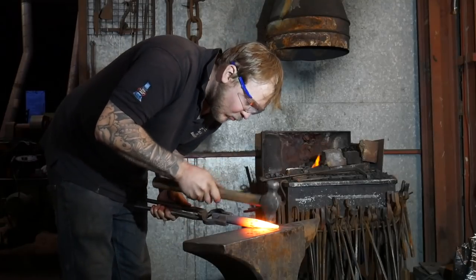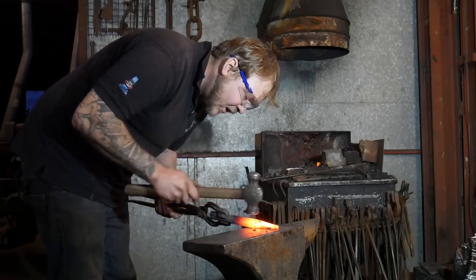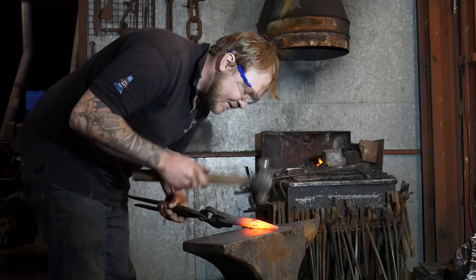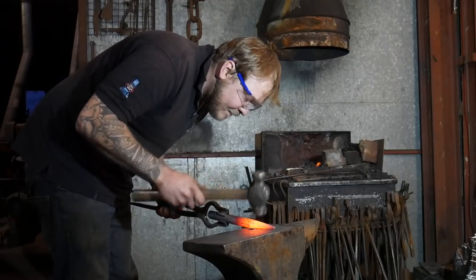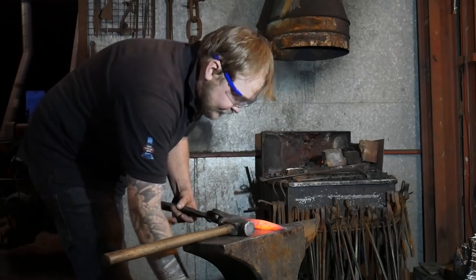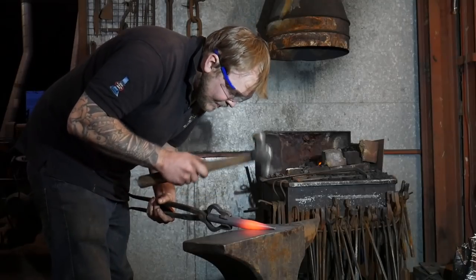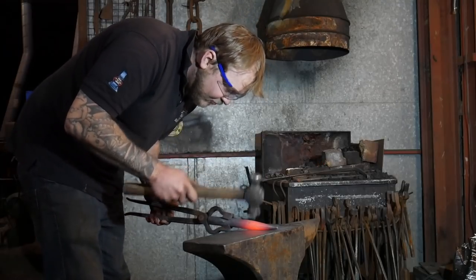I'm going to get a good hold here, work down that ledge again, and all I'm doing is blending in the hammer marks, overlapping everything so it all looks nice and tight, getting everything looking real smart. This is where you want to spend your time — everything up until this point has been material movement; now this is planishing, the finishing stage. I've choked up on my hammer slightly to create really nice facets, rotating on the top and bottom to give lots and lots of nice areas of rotation.